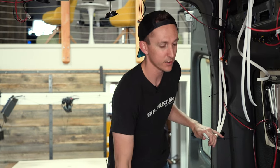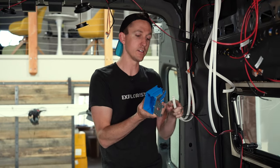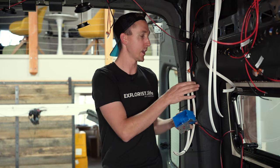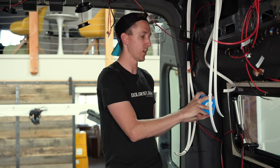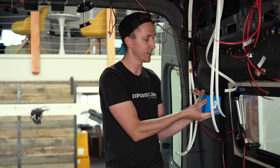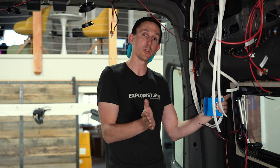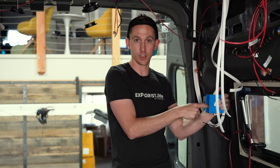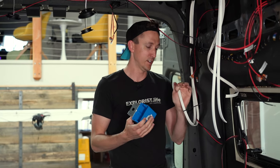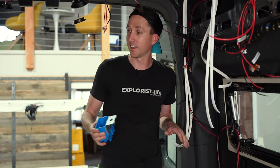The reason we don't have the outlets installed on the walls yet is because this is not the part of the build where you put the outlets on. The boxes need to be mounted and the walls need to be up before we wire the actual outlets in. We're going to have furring strips on the walls that these boxes mount to, and we don't have those up yet. Once the furring strips go up and the boxes get mounted, we can put the wires into the boxes. The wires need to be curled up at the back so we can use a Roto Zip to cut out the hole for the outlet. These are going to live just like this for now.